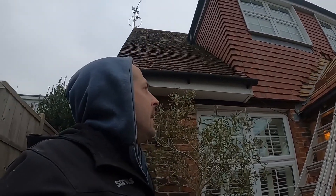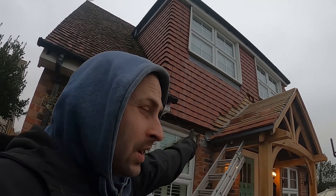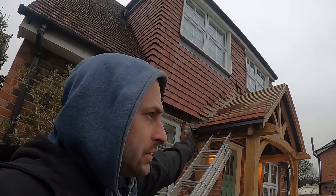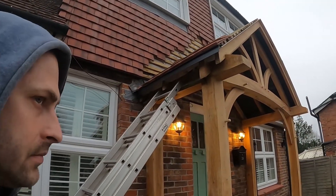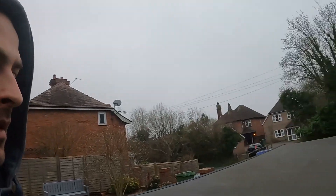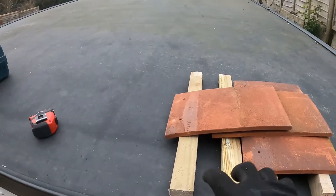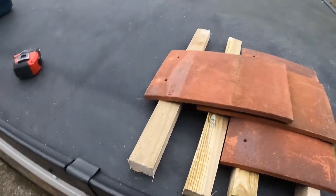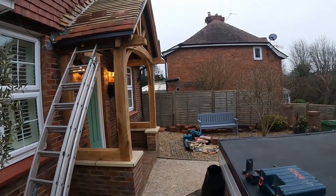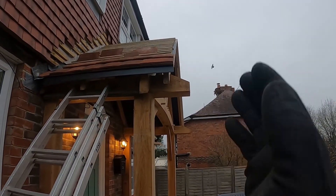In most cases you're going to have to copy the existing lap unless you're redoing a roof completely. In my case I copied what was there — my measurement was 105mm to 111mm, so roughly 110mm. These reclaimed tiles were 90mm spaced apart for the rows. When you start tiling, always start from the gable end — in my case this is a gable end.